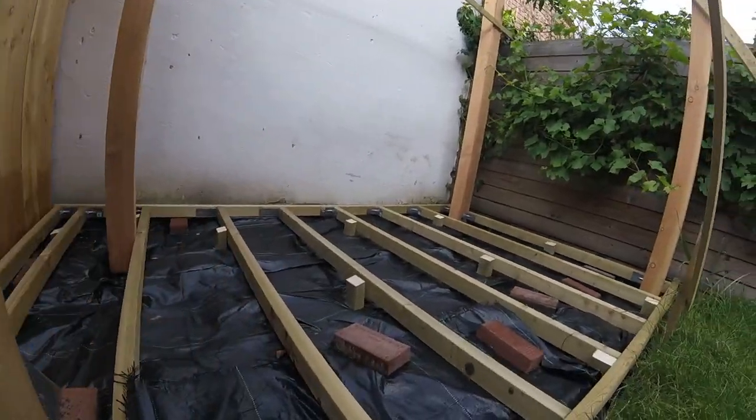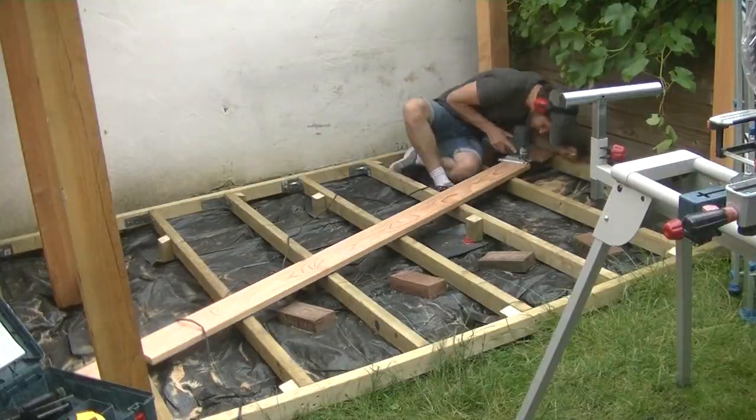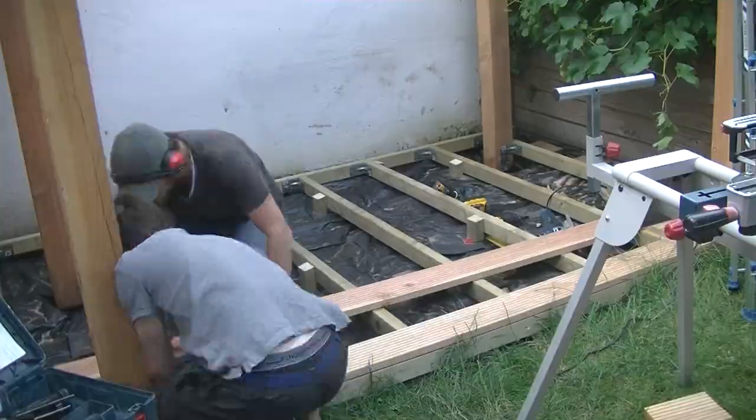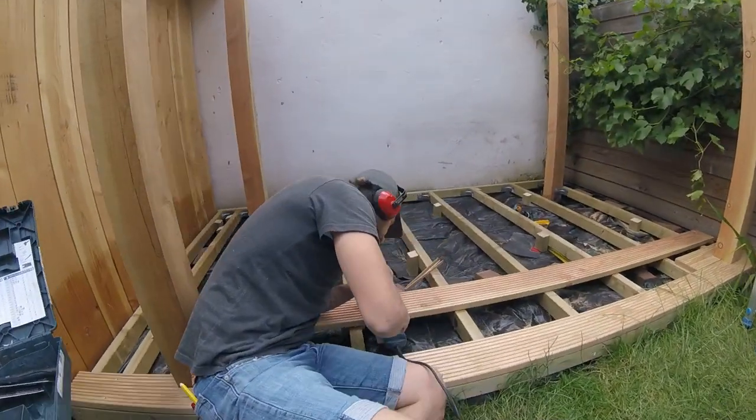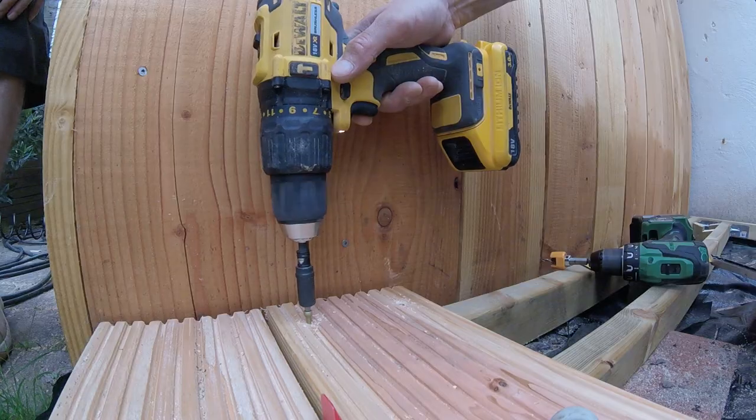Then the deck was on the list. With uprights the frame stands off the ground and a sheet of plastic prevents moisture coming up from the concrete footings. We focused on cutting the pockets around the beams; the customer did the placement of the other boards.